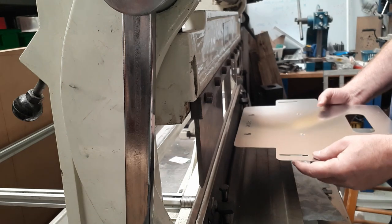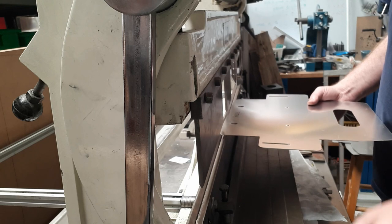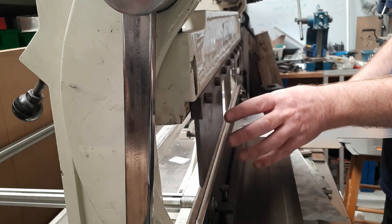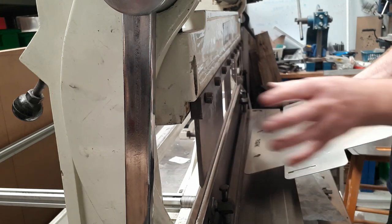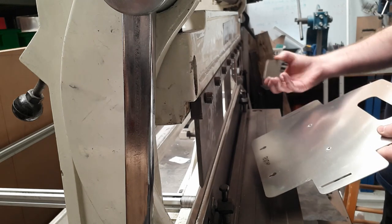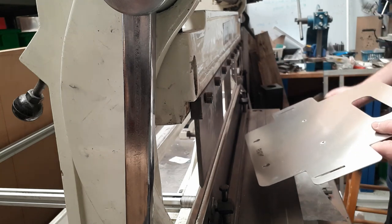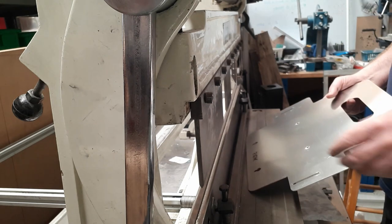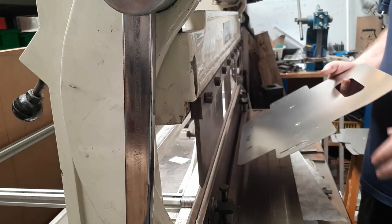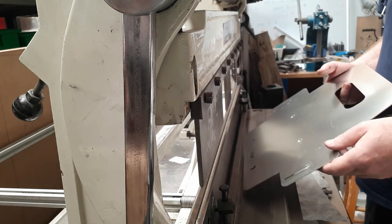The other element, from a production perspective, is thinking about what's the minimum number of changes you need to make to the tooling and blade sizes fitted to the machine. This machine comes with a variety of different blades — or teeth, depending on what you call them — that you can put in to perform different size bends. Keeping changing them out is going to slow down production, so the more you can get out of one blade, the better.